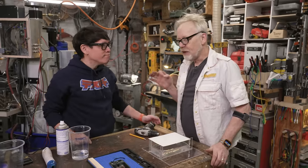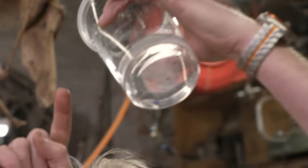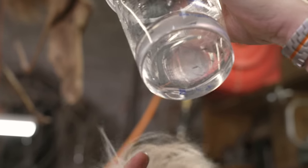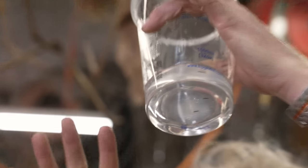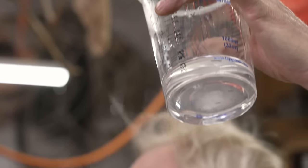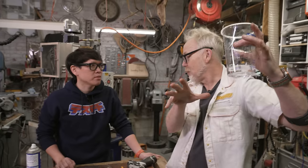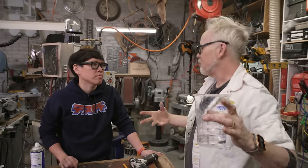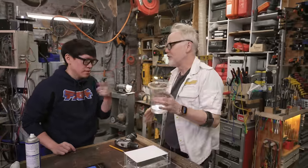If you look in here, you can see there are some artifacts of the liquid moving. What's happening when it sets is there's a thermal reaction, it builds polymer chains. And you can see in here, visually, some of those polymer chains. That's because I was moving this around at like the 3-hour mark, and that's why it tells you the working time is 2 hours, because that's how long you have to work with it before it starts to show artifacts of your messing with it.